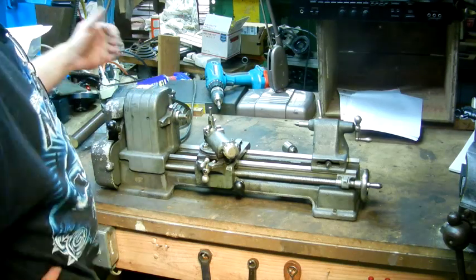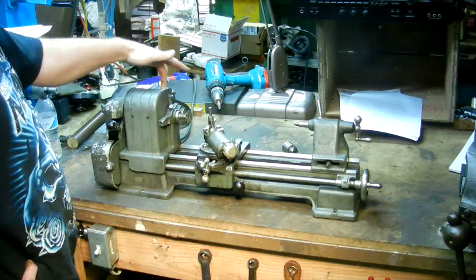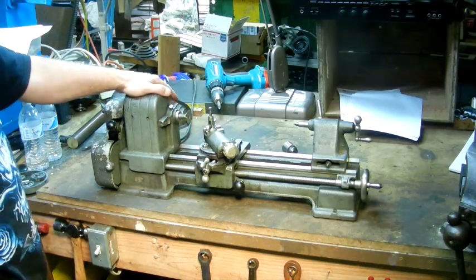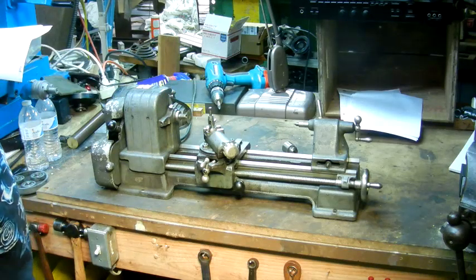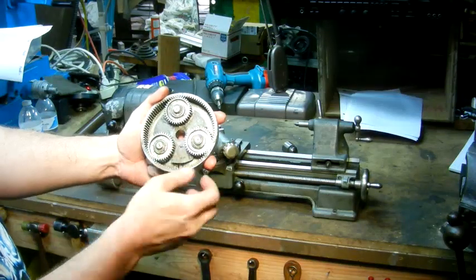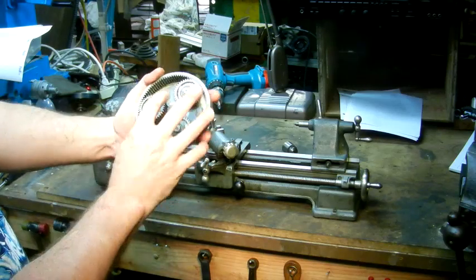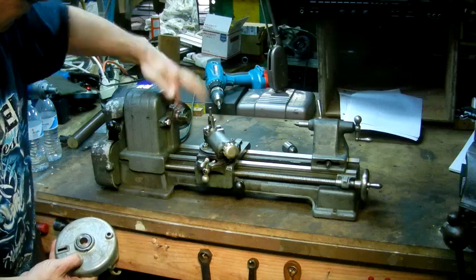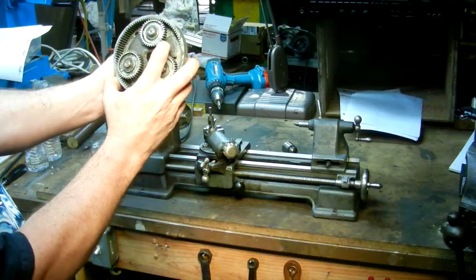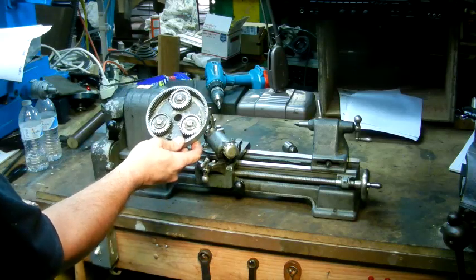The machine came standard without any kind of counter shaft. There's a direct drive pulley on the motor, and there are three steps on the spindle pulley itself. There's a back gear setup that gives you a total of six speeds, down to about 120 RPM up to about 1,325 RPM — that's with a standard 1,700 RPM motor. The back gear assembly is actually kind of unusual. There's a ring gear with the teeth inside it, and then a set of three gears that follow on that, keyed to the spindle to give you the reduction. I believe this gives a five-to-one reduction, so it gives you a pretty useful range of speeds.